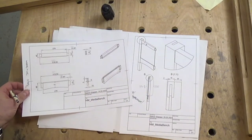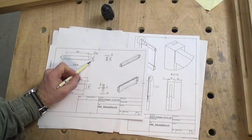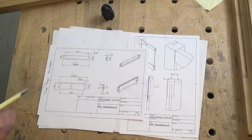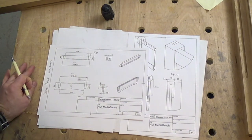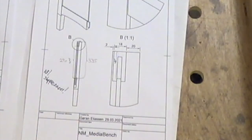I had originally planned a horned tenon here, or a haunted tenon, as Autocorrect wants me to call it, but ultimately it went with an open mortise. If I were to do this again, I would have used a horned tenon to retain more strength in the leg. But then again, this is a turntable stand, not a dining table, so it doesn't need to withstand a lot of racking.